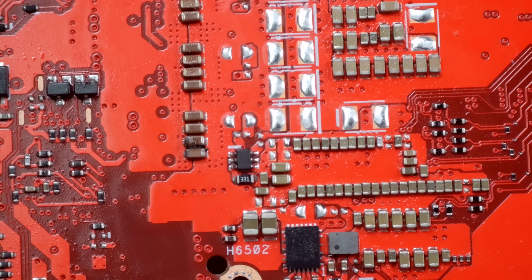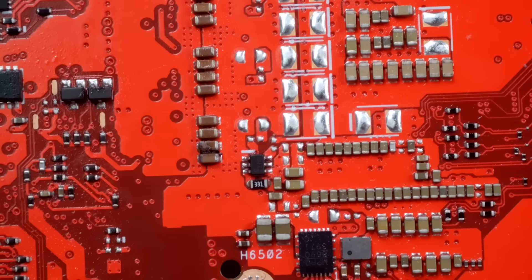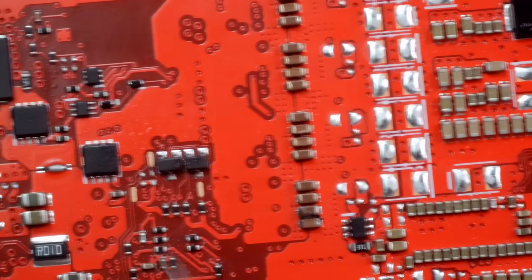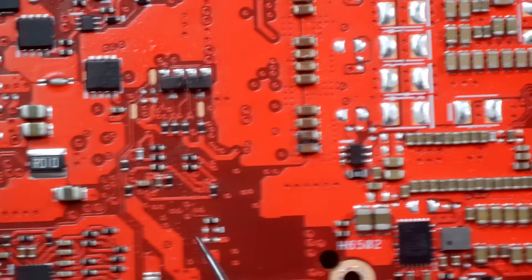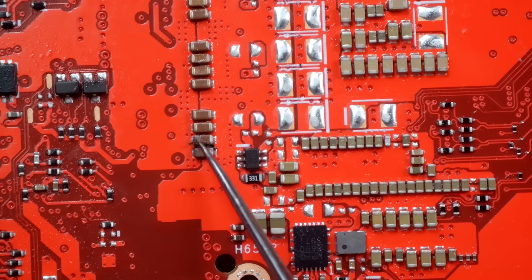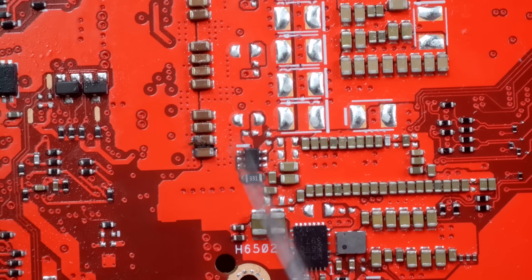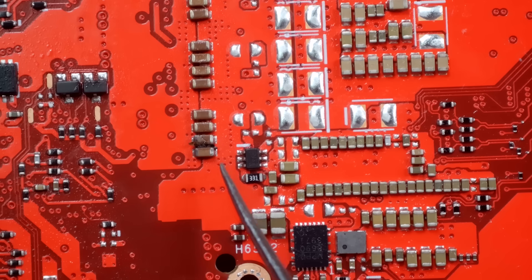That tells me that there is probably a lot of voltage that went through this, which tells me that somebody who took it apart probably bridged two points that weren't supposed to be bridged and caused a voltage spike that blew out this capacitor. Now it is possible that that capacitor is the only problem on this board, but it is also possible that voltage went through this capacitor and into other chips on this board. If that's the case, this board might be toast, but I think we should first replace this capacitor and see if that takes care of the shorts.